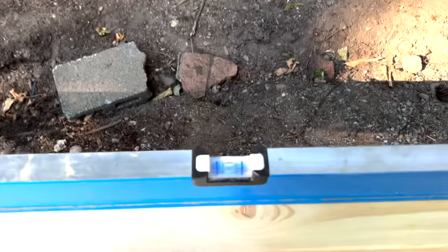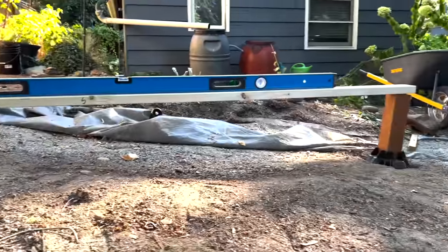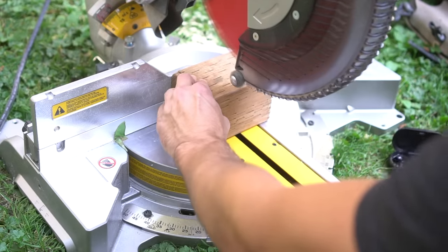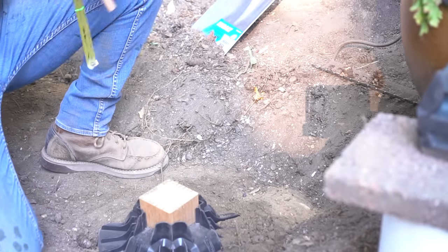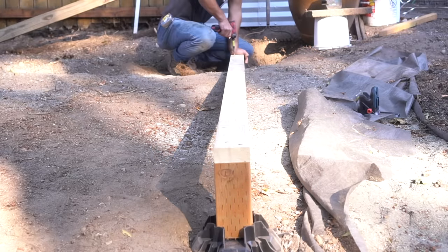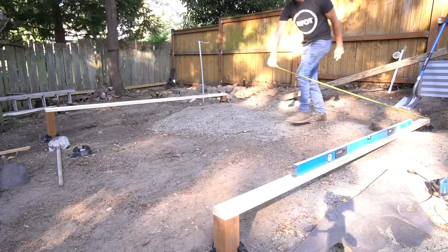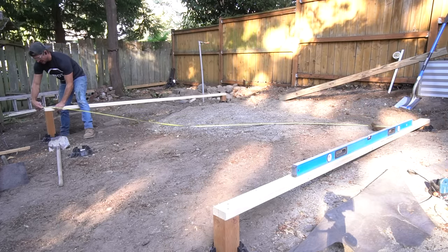but when you get up close, boy, that is quite level — which is a good thing. But we've got a lot of space over here, so I'm going to cut that one down as much as I possibly can. The lowest I could go with these posts is two and a half inches, and I actually dug that first one down just a bit to relieve some of that extreme height difference between one side to the other, which helped by removing a total of five inches of height difference. Screwing two 10-footers at these locations helps the measuring process because it guarantees perfect 10-foot sections and ensures our cross-dimensional measurement is equal.